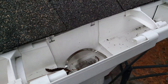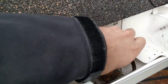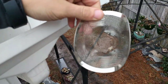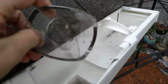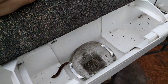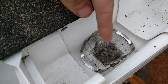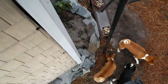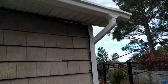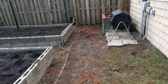The next thing to do would be to filter at the gutter level. I bought these at the dollar store — they're regular sink drain catches and they're stainless steel so they don't rust out. They're cheap because you get a three-pack for a dollar, and it's relatively easy to just climb up every couple of months, depending on how much debris you have falling into your gutters, and keep them clean. That keeps less sediment from going down into the pipes. Definitely have a solution for screening. Some people get gutters that have complete screen tops on them; I looked at a couple of those but they're fairly expensive.